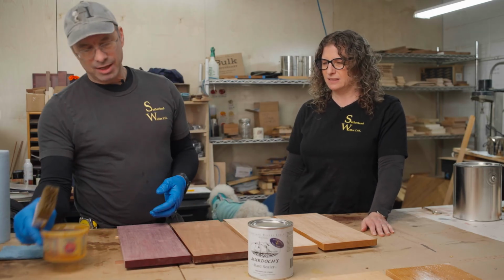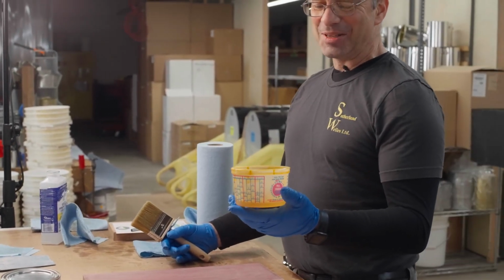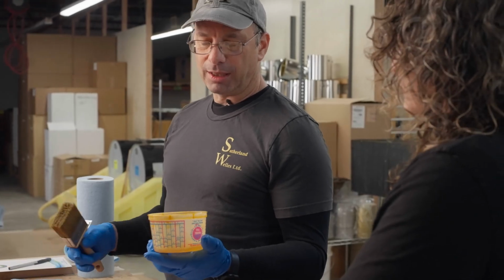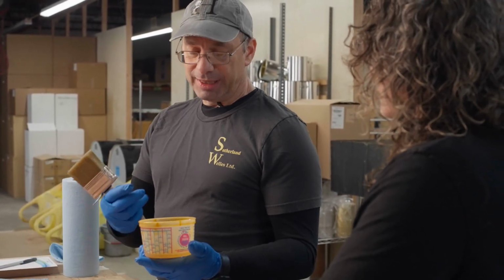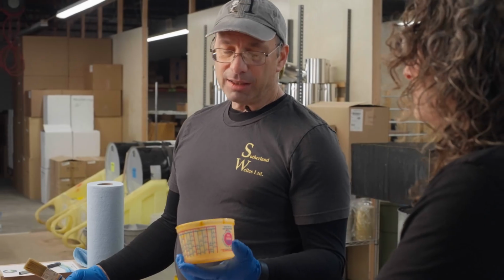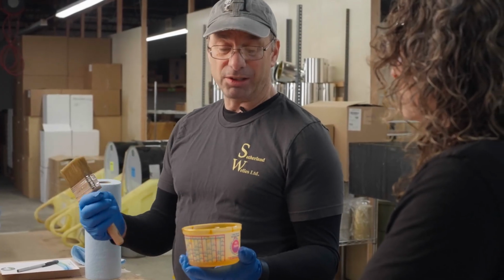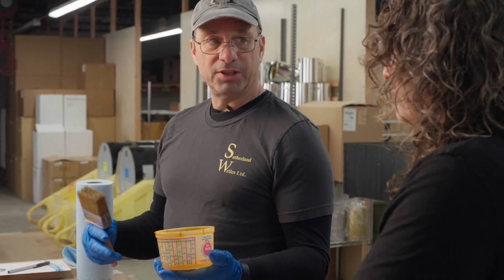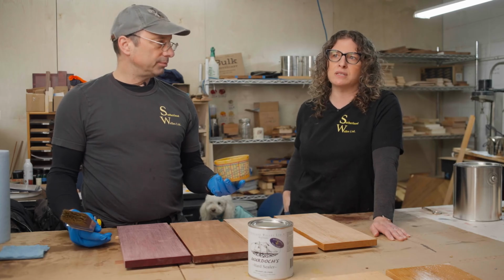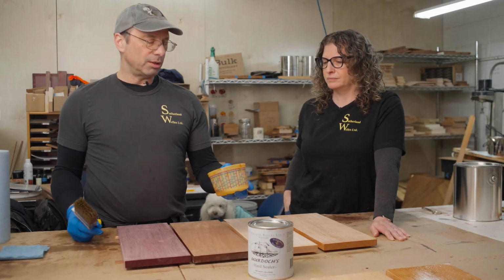Now the nice thing about the hard sealer is its odor. It actually has a bit of citrus smell in it. It smells nice. And you're not used to that with an oil-based finish. You're usually used to something that's going to knock you out. But this smell that's emanating from it is the citrus solvent that we use in it, where our original smells more like tung oil. And it's not masking anything that's nasty in there. If anything, it's just masking the tung oil smell, which is that nuttier smell. Very similar to some of our other finishes that contain the citrus. And it's also VOC compliant with all the states that have VOC regulations. It's lower than 275, which I think is required for clear wood floor finishes.